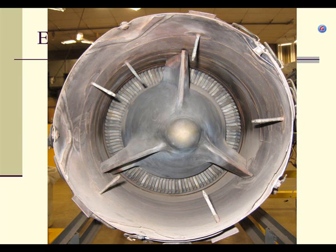Looking into the tail end of an engine, it's clear why the inner cone is there — gases come out of the annular area around it. Notice the struts: they're curved. Coming out of the turbine, airflow exits at a slight angle, and these curved struts help redirect and smooth that airflow. The section from the tip of the cone to the wall is the diffuser section; from there outward it narrows down to a nozzle.